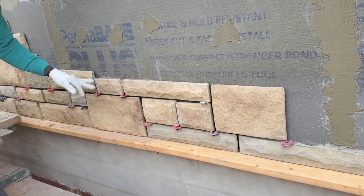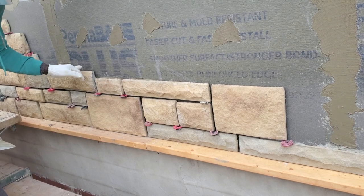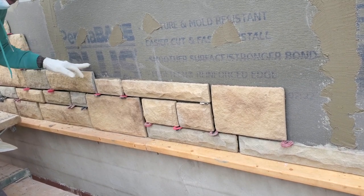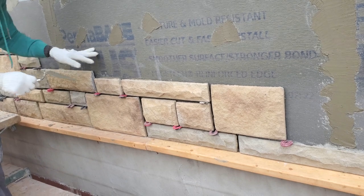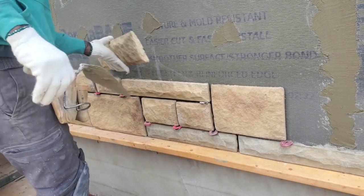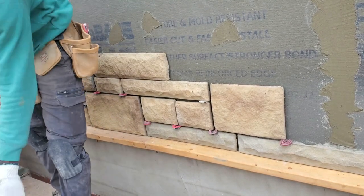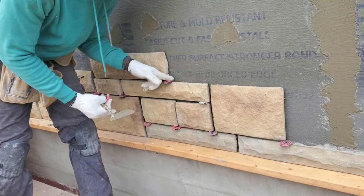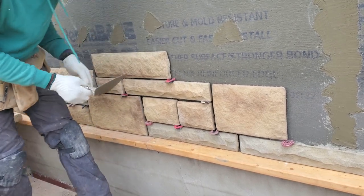So now we have a medium and a small. Once you have a small, most likely it's calling for a medium. So right here we're going to put a medium, and then there's going to be a small on top of the medium to bring it up to the same height. Remember — once you have a medium and a small, they have to add up to be the same as the big. So once you reach that height we're going to have to put a small here and then break this line. Put the spacer in halfway so that when you're laying the next stone you can maintain the same level.